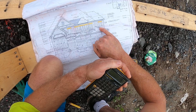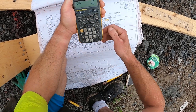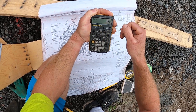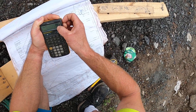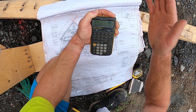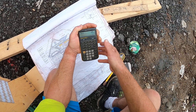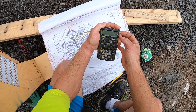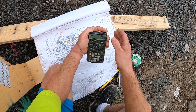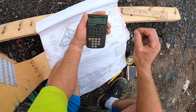Now to find your hip extension — long-to-long to long-to-long hip extension — you simply type in, just like before, four-inch convert hip, and it's going to spit out that number. I reduce it a little bit on the hip to account for getting it nice and straight, so I might take an eighth off that — I might cut that probably a half, let's say 39 and a half long to long with bevels on the top. And I find by doing that, it turns out really nice and straight.